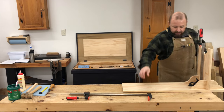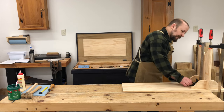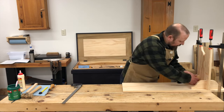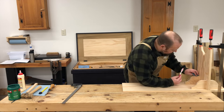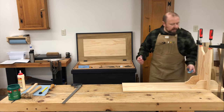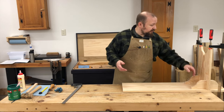I'm going to put a couple of clamps just on the leg to help hold it all in place while everything's drying. The clamps will just help a little bit more. So that's nice and square. Check for any additional squeeze-out. Okay, that all looks pretty good. Now we're just going to leave that to dry and we'll come back when this is dry and finish this assembly up.